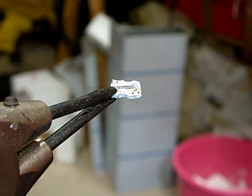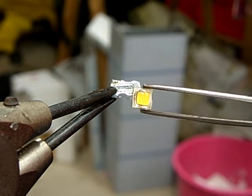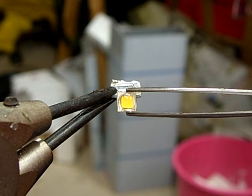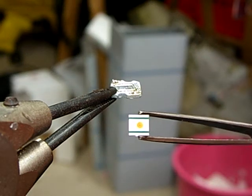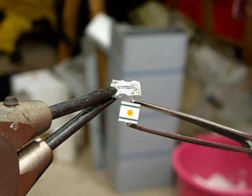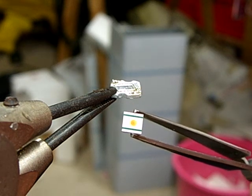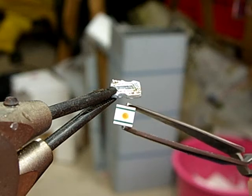I will not bother to search for it right now, but I have the new LED here. It's an XM-L2. You can see it on the silver-plated ceramic base, and on the lower right corner you see a little black dot — this marks the negative contact. On the rear side, you can see a little brown spot which is actually the copper. The base contacts of the LED are copper, which are silver-plated. It seems that in the center the plating is very thin and some of the copper is shining through, so I'd just consider it a discoloration, a little one.